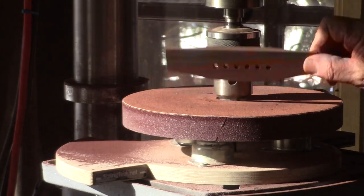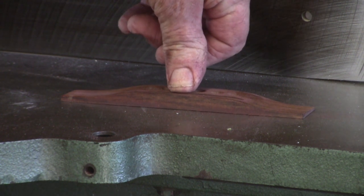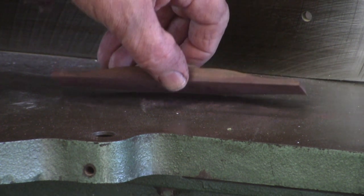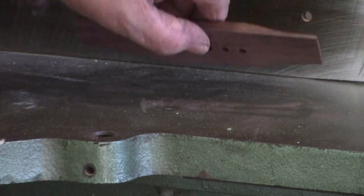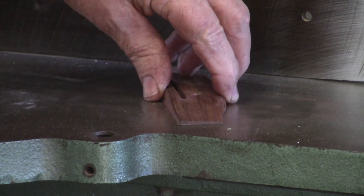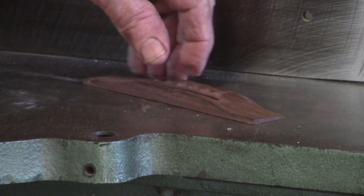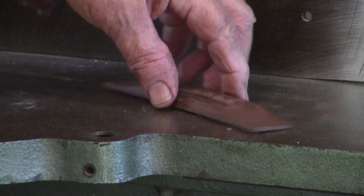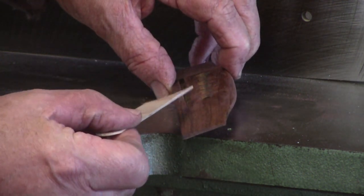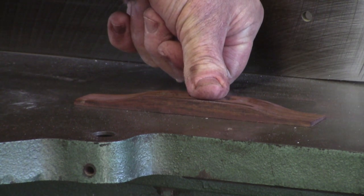We have arrived — 100% contact. Over to the jointer table. See how slight that radius is? Because it's a spherical radius the bottom side of that surface has been held up against a ball 48 feet high, meaning the perimeter of the bridge will make contact before the center. That little bit of flexing is going to guarantee you 100% contact. I have actually tilted the bridge back, which buys back all that real estate of years of string pull, but it also increases the tension at the focal point on the saddle. As the bridge leans up, the tension decreases at that focal point; as it tilts back it gets tighter. This is just good physics for the guitar — acoustically and structurally.